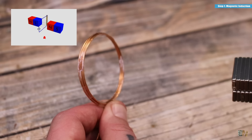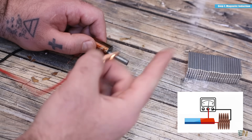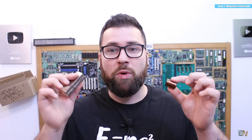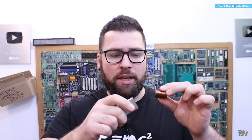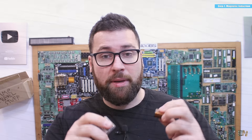This process is also vice versa — it could go both ways. If I apply a voltage to a copper coil, it will create a magnetic field. So with a magnetic field you can create voltage, and using voltage you can create a magnetic field. But it's not that easy. When I move the magnet in front of the coil, it applies some kind of force to the coil. But then the coil will apply the same force in the opposite direction to the magnet, because that is Newton's third law — to any action you get a reaction. So basically, the magnet gets slowed down by the induction process.